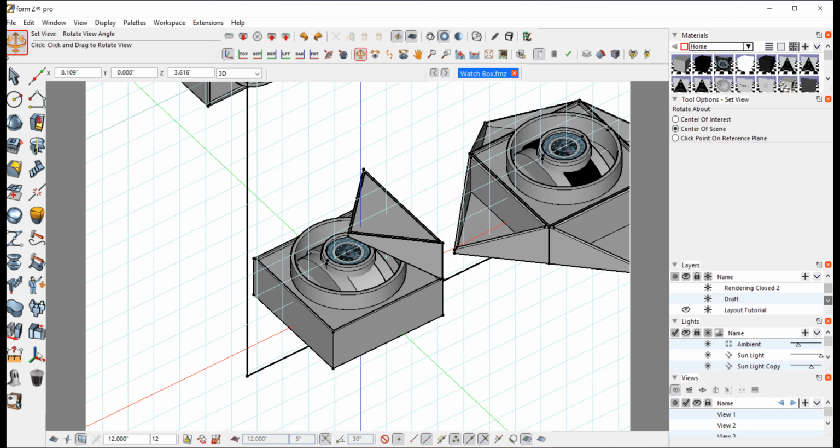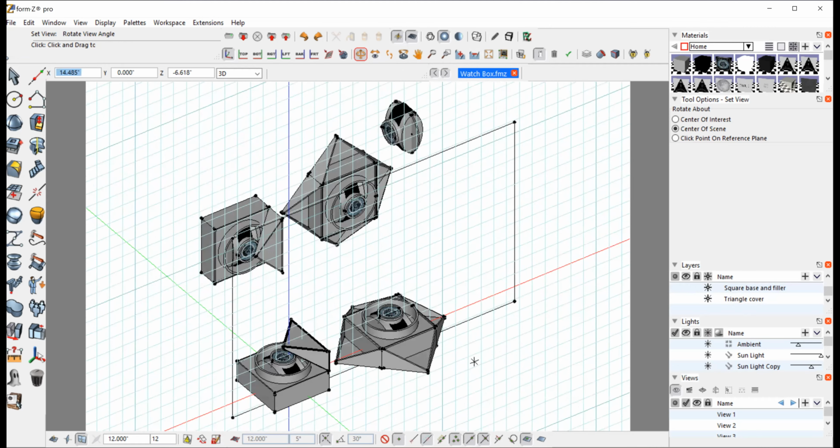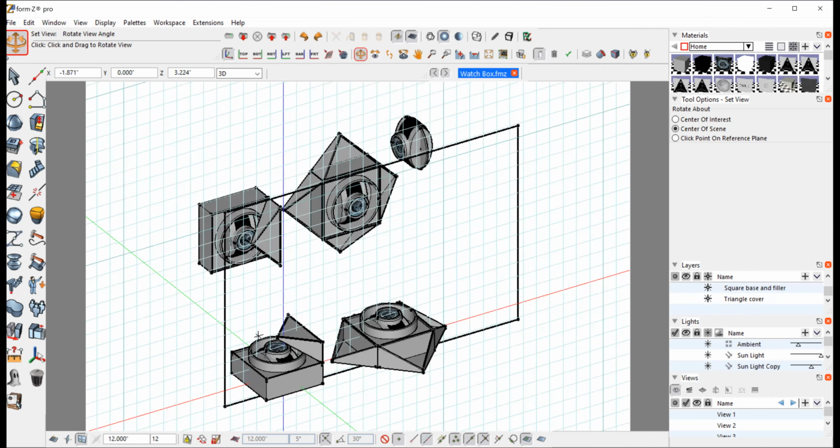Like I was saying, I'm calling it a shop drawing. It's something that you're going to work with to build all these pieces. And it will be a bit of a guide, but you kind of want to go through this process to see how all these parts are going to fit. So you can see right down here in the bottom is where we're starting from. So all I'm doing is taking all those components, and I'm just turning it sideways and putting it above that to create these orthographic projections.